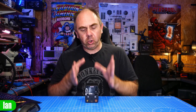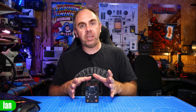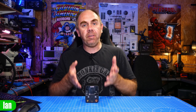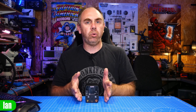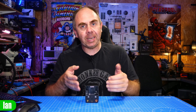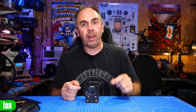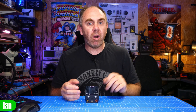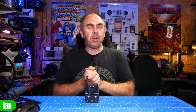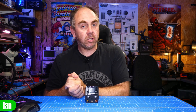In the end I have absolutely tortured this power supply for two days — I have shorted it, over-currented it, and forced it to shut down, yet it has not failed. Overall the unit I have here appears to be a good supply. However I do want to raise concerns about the short circuit behaviour: it should be shutting down much faster rather than dumping 10 amps into the leads. This is a potential safety issue — you could have a short and not know about it because the supply keeps dumping current in rather than shutting down. I'm going to raise this with Toolkit RC and hopefully it can be addressed in a future firmware update.